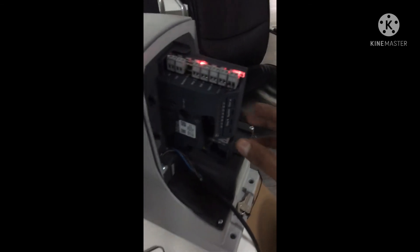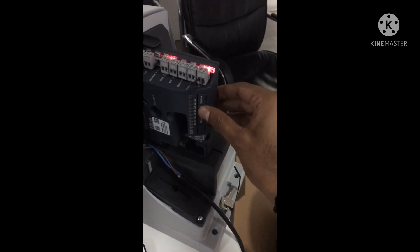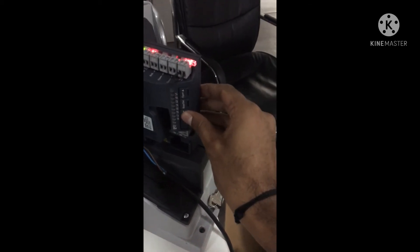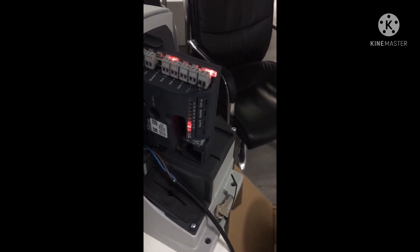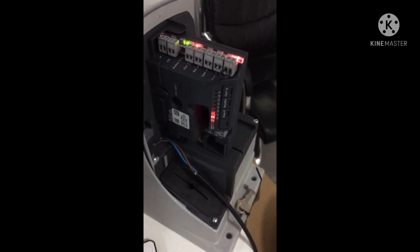After that we need to switch on the slave mode in the slave motor. The procedure is: press the stop button — LED L1 will blink; press close button — L2, L3, L4, L5, L6, L7, L8 — and press. Now LED L8 is continuously on, which means slave mode is on.